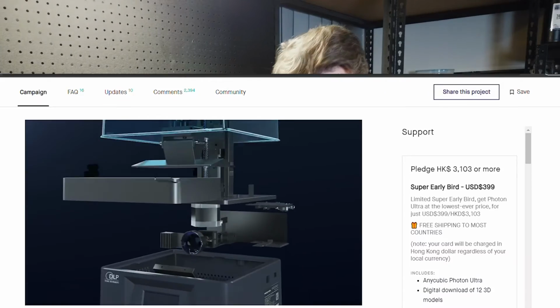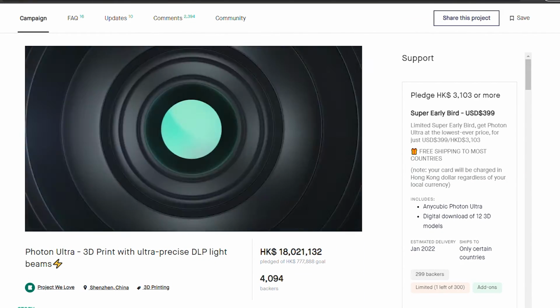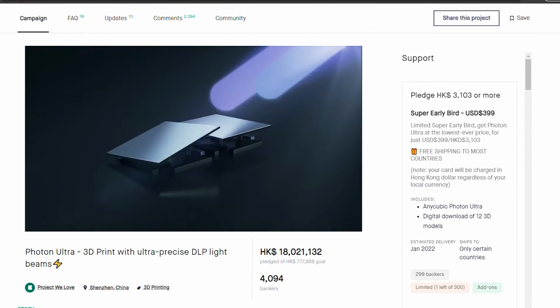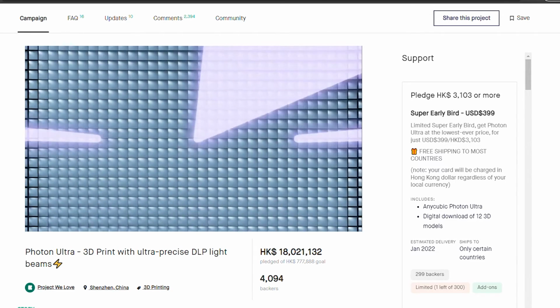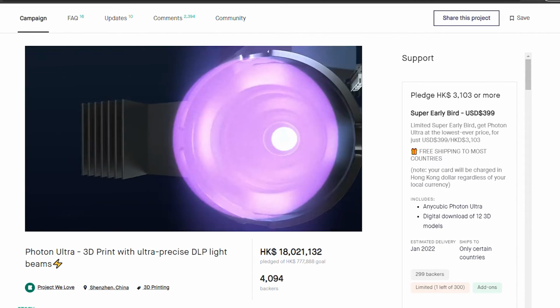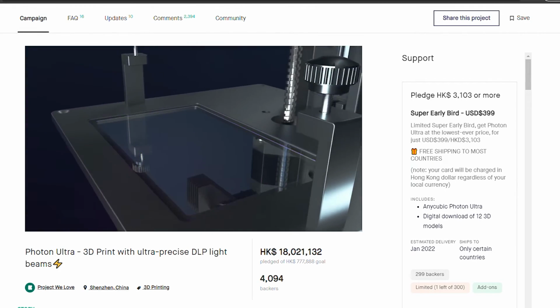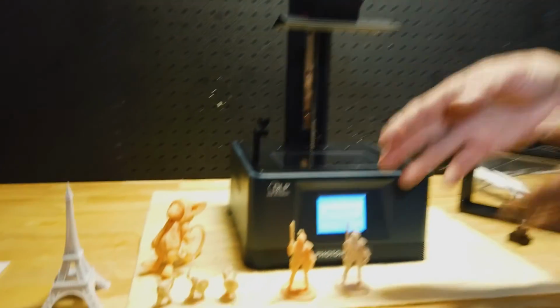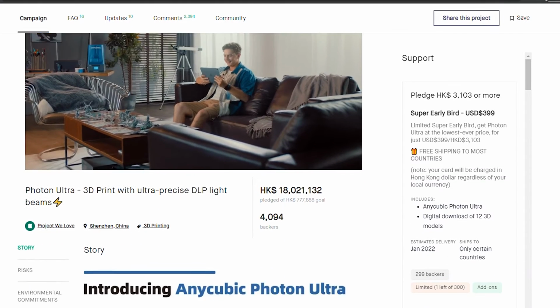It's essentially a micro mirror with, in this case, a 720p resolution that sits on a circuit board, and the light shines on that mirror and gets reflected off. The mirrors just turn slightly to make that light go off to a different direction when the pixel is off. Now, they're the only company that have that technology because they have a patent on it. And because they've got a patent on that technology, they can charge whatever they want for it.